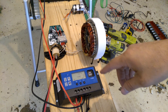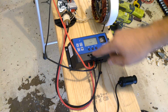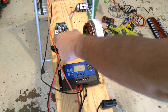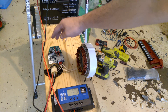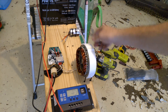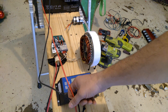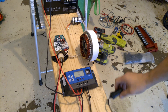Let me explain this and show you how I plan to get charge into the battery. If you follow this line, this is our solar line, and this is where I'll be getting power from the wind generator. This was the shaft where the wind turbine would rotate around, so there's a weird little connection there. And then there's this little logic board here that will flow electricity once there's a steady spin on the generator. Once there's a steady spin, it activates and begins to dump power down this line, and this charge controller feeds that back into the battery while at the same time continuing to power the accessories.